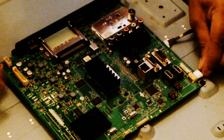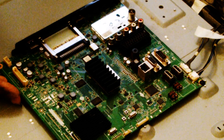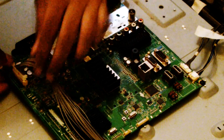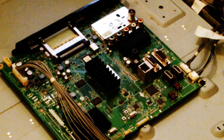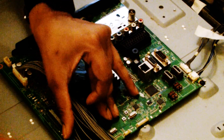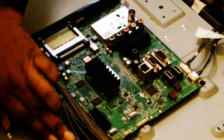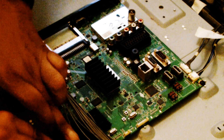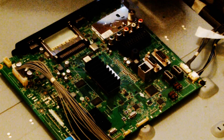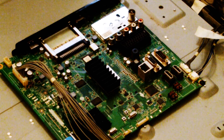So what we're going to do is reconnect this board up. Plug these back in, plug this back in. We've got this little connector here which has to slide into the slot and once it's there you just need to clip it down. Just make sure it's in, clip it down. I can't remember if anything was going in there - I don't see a wire for it. One, two, three, four - don't think I missed anything.